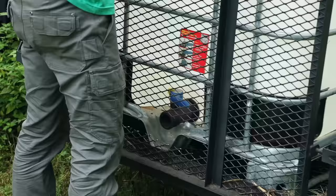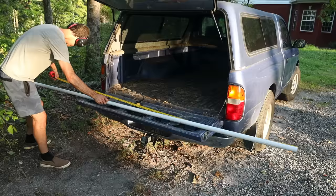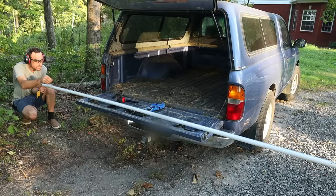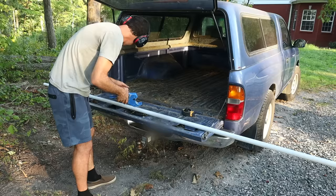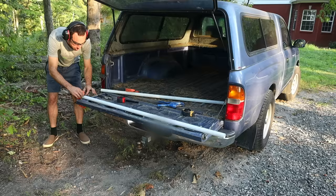I also need to be able to pull this, so I need to go up a bit higher and take a little more off the bottom. I can take a file or my grinding wheel with the steel brush to clean up these edges so you don't rip your hand apart. Using a round pipe as a guide makes a pretty straight line very easily. Now I'm going to cut it in half — working with half the pipe at a time is easier to clamp down. I'll leave the end where I'm putting the cap alone so the structure stays stronger.